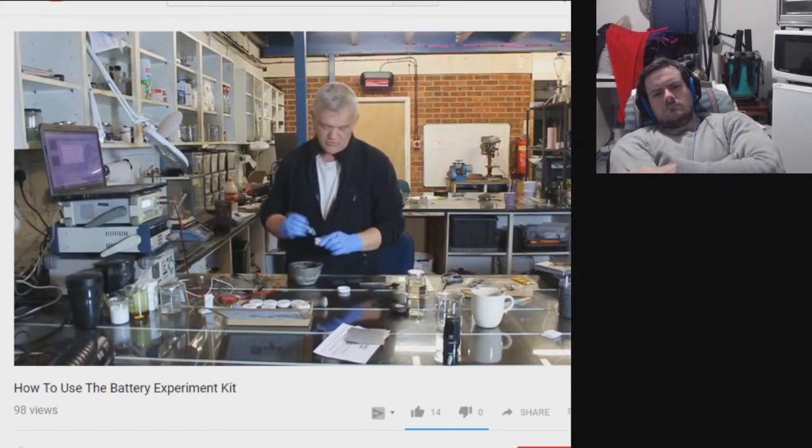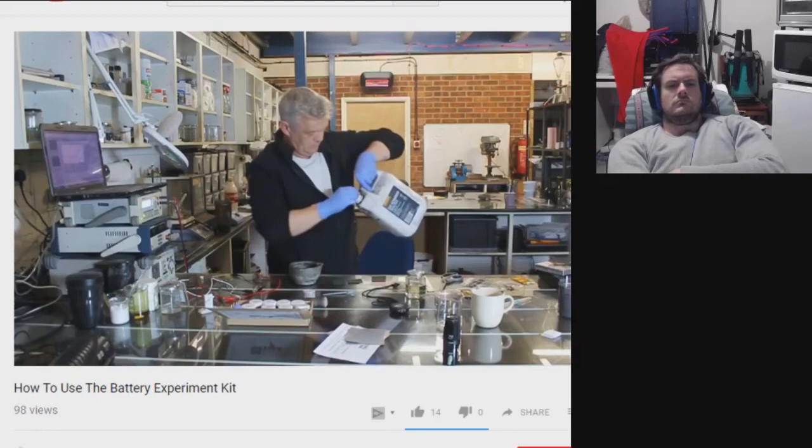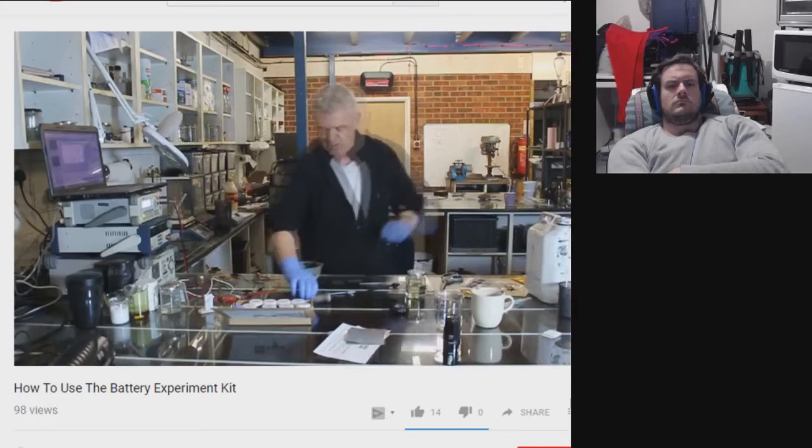Now, it's quite difficult to mix that together because the binder will be sucked into the dry salt that we've just added there. So what we need to do is add a little bit of DI water to help us mix it. So put a little bit of DI water in there, and I've added 5 millilitres of DI water, and we can give that a go around.